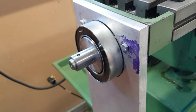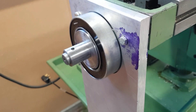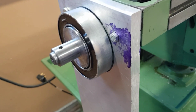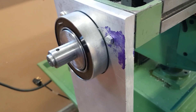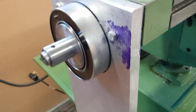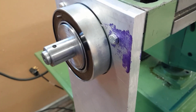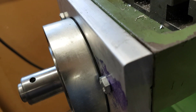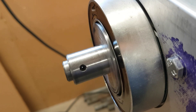When we last left off I was saying that there were a couple of things I needed to sort out, and one of them was drilling the hole in what I'm classing as the fixed element. That part needed to be fixed to the shaft which will allow the rotation, which is done - albeit the grub screw I cut was a little short, but it's holding in place. If I swivel around you can see that obviously when I turn one side, the other turns with the shaft.